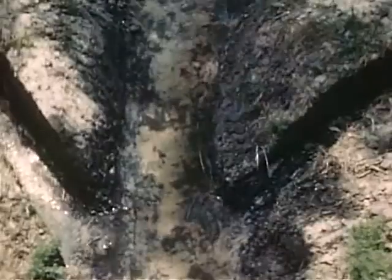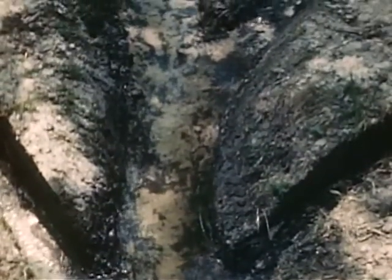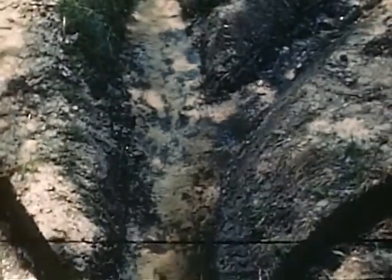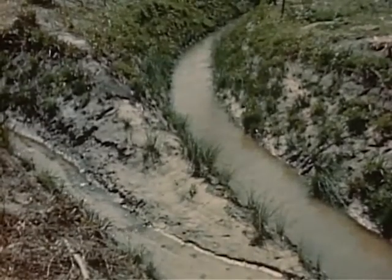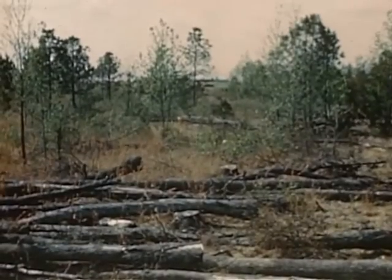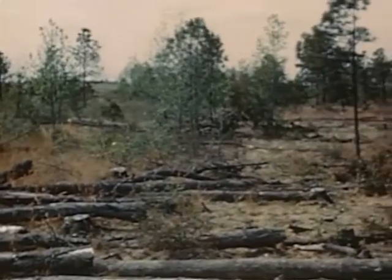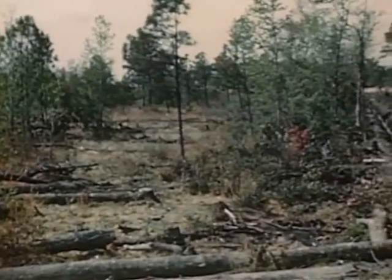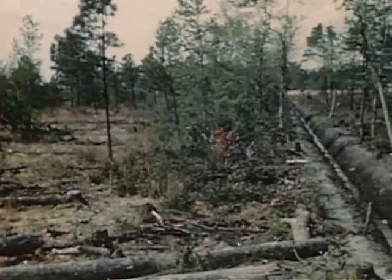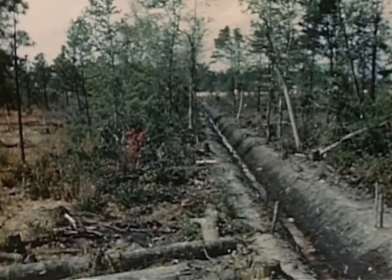Laterals enter the main ditch at angles designed to avoid any disturbance of flow in either ditch. Abrupt angles were avoided, and the discharge enters the main ditch a few inches above its bottom. Complete drainage of this area has made reproduction of the malaria mosquito impossible. This is no longer a problem area. The land has been reclaimed, and its development may offset the entire cost of the project. Here, hand ditching was the practical answer to malaria control.